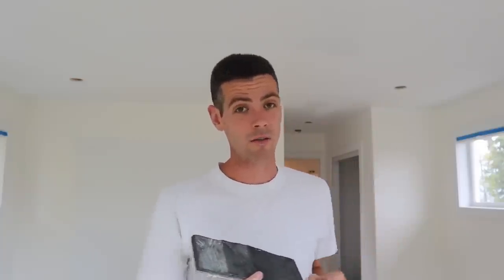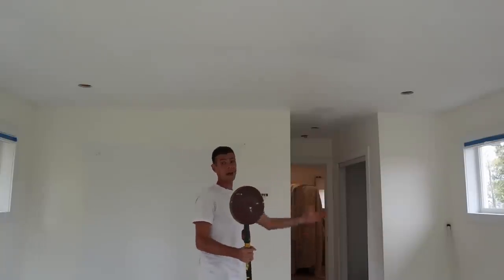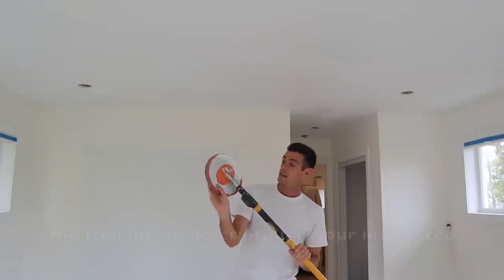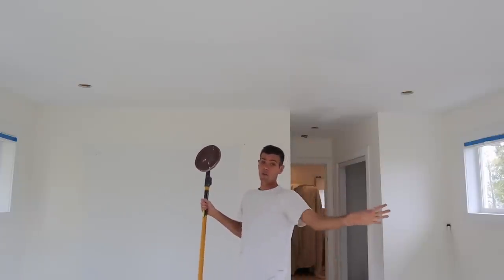The last thing I'm going to do before getting ready to paint this whole ceiling is give it a quick sand to knock down any boogers left by the people who primed the ceiling — and they are plentiful. First I'm going to run around the corners with 100 grit on a pole to brush them out real quick. Then for the main ceiling I've got one of these Radius 360s — these things are great because they cover a lot of area. I've got 120 on here and it's just once across the whole room.